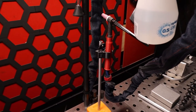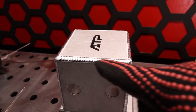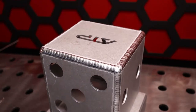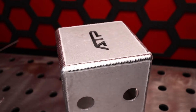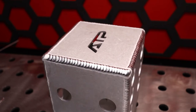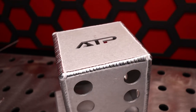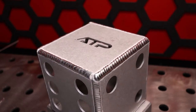That's a 3D printed broomstick handle holder. This is the AC pulse welded side — there are some really good looking welds in there. That cube was tumbled in ceramic media, washed with some Simple Green and then wiped down twice with acetone.